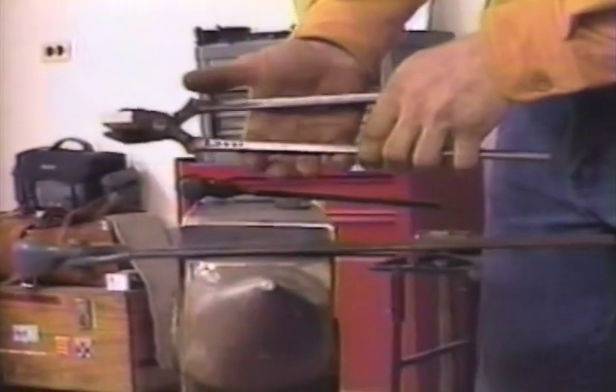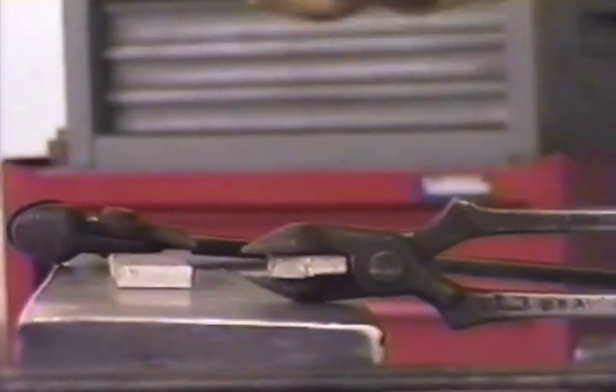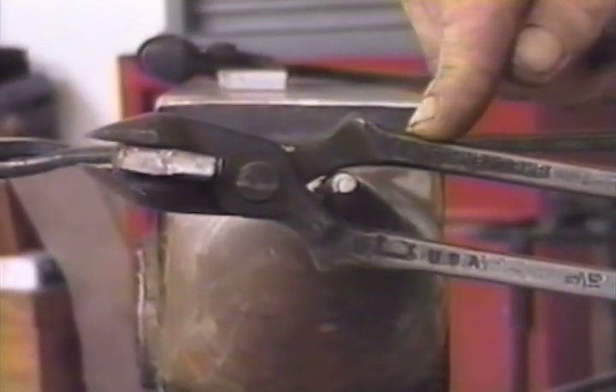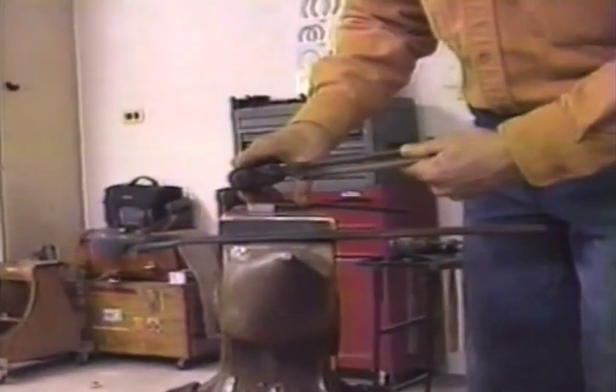If not only the jaws are mismatched but the reins are also too far apart, take a longer heat to get heat into the area behind the rivet. Place the proper stock in the tong. Not only set the jaw — if the heat is even on both branches, you can squeeze the reins together to bring them to the desired width. Or set the tong on the horn and tap each rein down alternately to keep the reins parallel.